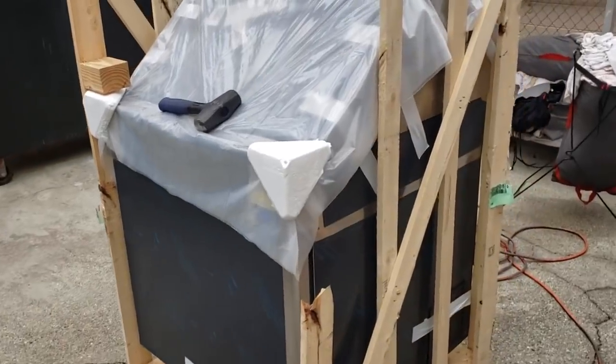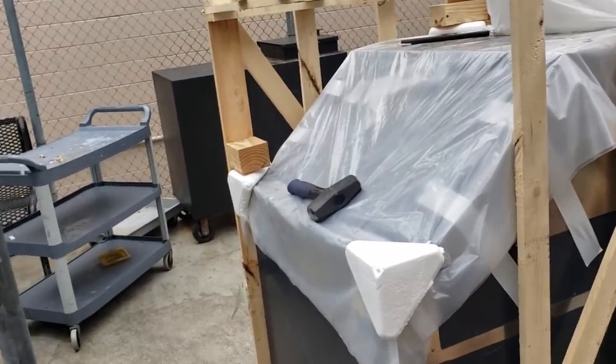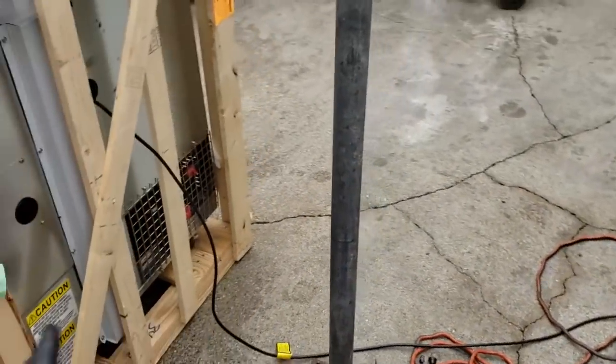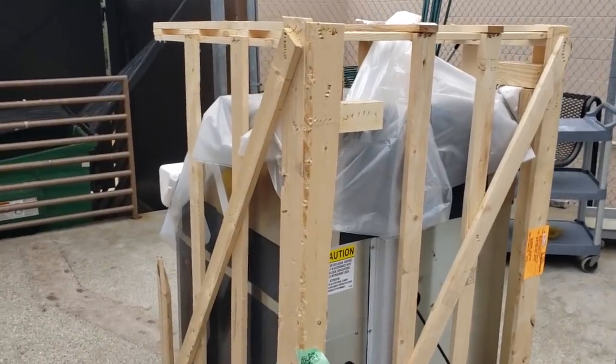I'm doing an installation of a new refrigerator today — you can see it's still on the pallet. I'm just slowly uncrating it. Something I like to do on new installs is plug them in. There's nothing blocking the condenser, so I plug the unit in so I can see it come down to temperature before I remove their old reach-in.